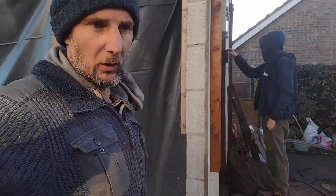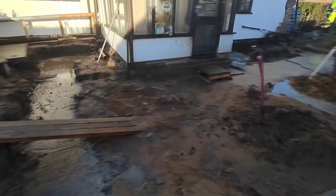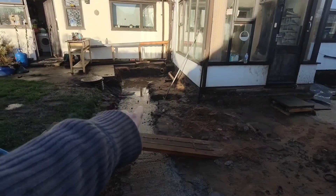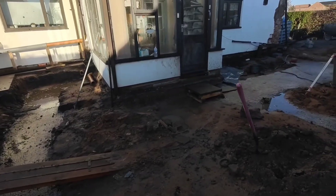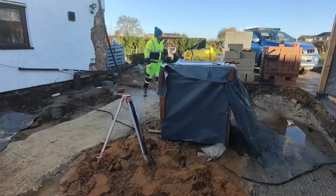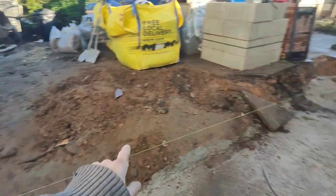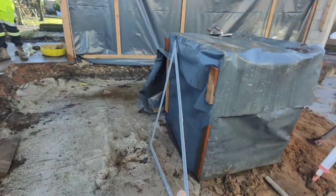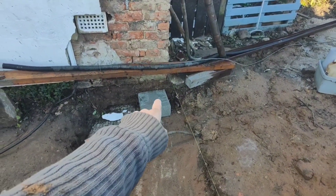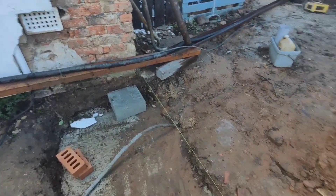This is all concrete. You can see where we just had a drop on the back — I won't drag it from there to there just for that little drop. See that puddle? It's a little bit hard down there and we need to sort it out. In fact, I think it's a lot out, not just a little bit. That's what we're going to find out once we get these lasers on. I've just pinned this line and I've got my big square today, so just squared that up. I think we're going to go for a block foundation, block on the inside, and three-quarters of brick on the outside.